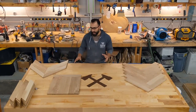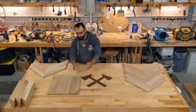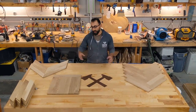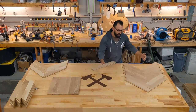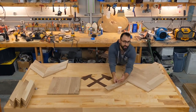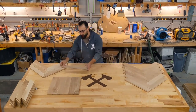One important thing to note with herringbone is the length of the piece should be a multiple of the width in a true herringbone pattern. That's not 100% imperative — you could still build a herringbone floor where the length is not a multiple of the width. The one thing you'd lose is that every other row, which should be oriented the same direction, would have seams that no longer line up perfectly — they'll be offset slightly.